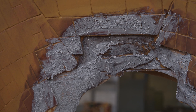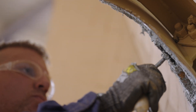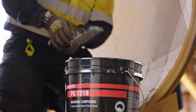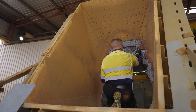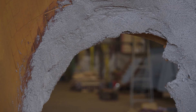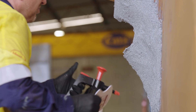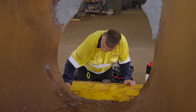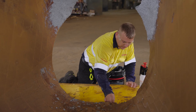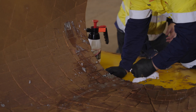Before the mixture dries, visually inspect for pinholes and any missed areas. Once the coating is cured, repeat visual inspection to confirm absence of pinholes, voids or damaged areas. If repairs are needed after application, we recommend lightly abrading, cleaning and then applying further product to the needed areas. After application of the adhesive, be sure to clean any tools or spills immediately with the appropriate solvents.